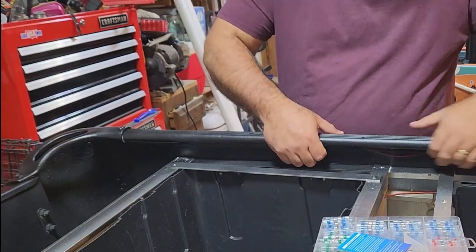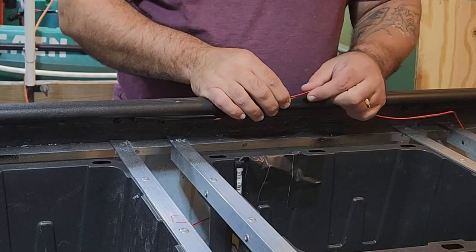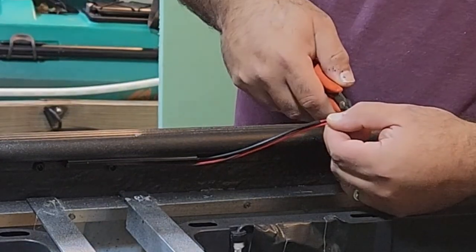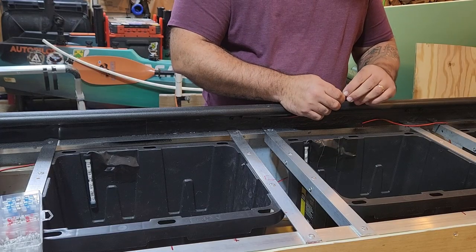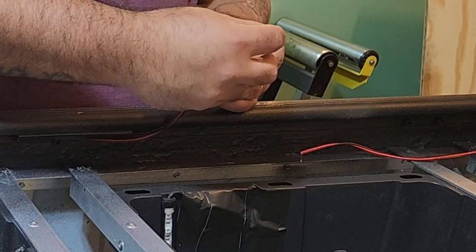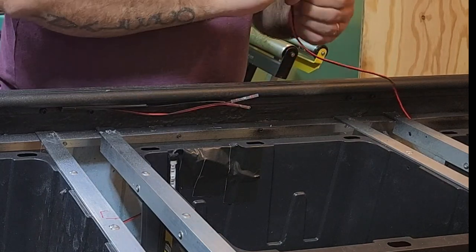Now that we know that one is good, we can continue our parallel wiring. Now, the technique that I like to use here is I will cut my primary wire to exactly the same length as the lead wire coming off of the light. And what it's gonna do is it's gonna make a Y, right? So the main leg is gonna continue forward, and this leg is gonna go right to the LED. So to keep it neat, all we do is cut it flush, because when we go to strip these wires back, these two are gonna share one side of the solder seal connector. And that's actually what makes it parallel, is that the 12 volts, because of that Y, continues all the way through. Those get fed through together. These two get fed through together. And it doesn't matter which side you share on. The reason that I choose to go with this side is because that's the direction the wire is facing. It's just a neater, tidier way to do things.